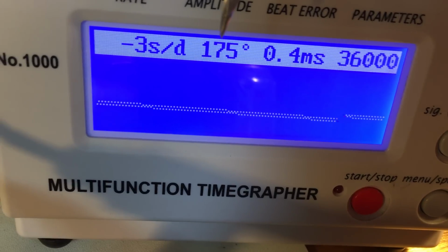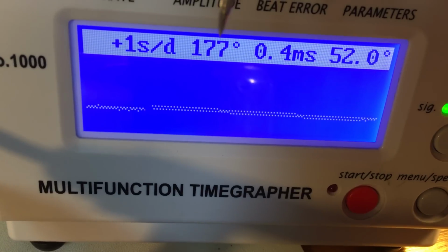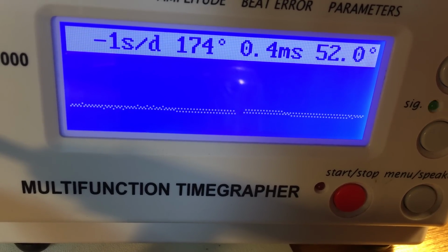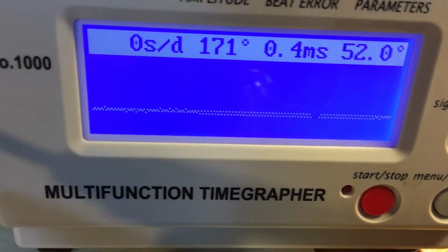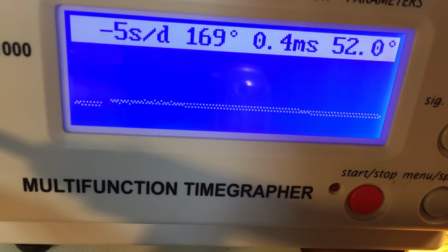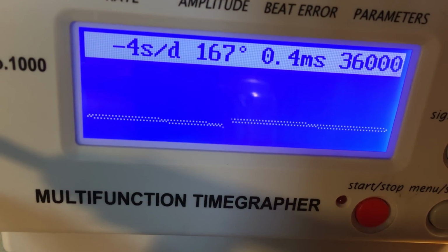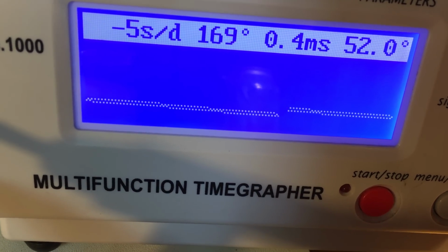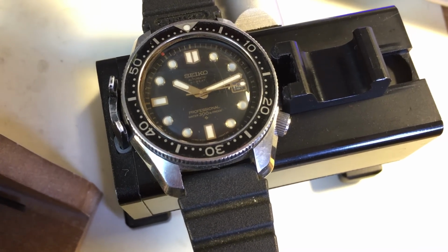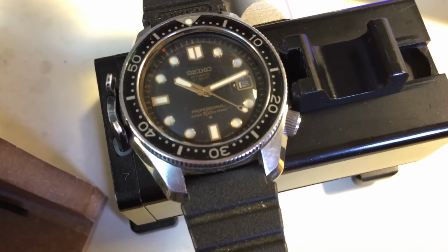You had talked about wanting to get this thing up to high numbers. Again, as I said before, I really wouldn't worry about shooting for amplitudes of 275 to 300. It's possible, but the mainspring barrels on these are permanently sealed, and there are no replacements. There's no way for me to take them apart and rebuild them. It takes some very careful work. There's only one person in the world I know of who can rebuild these mainspring barrels, and it takes surgery to do it because they're not supposed to come apart. This same person says he's happy with these running at lower amplitudes because lower amplitude means less wear on the pallet fork, the pivots, and the balance. Those things are important because these replacement parts are extraordinarily hard to find.